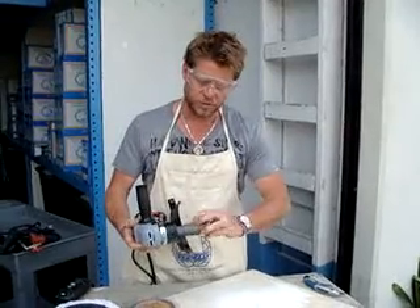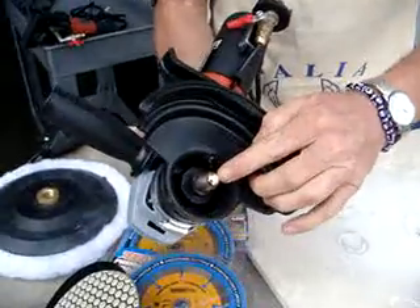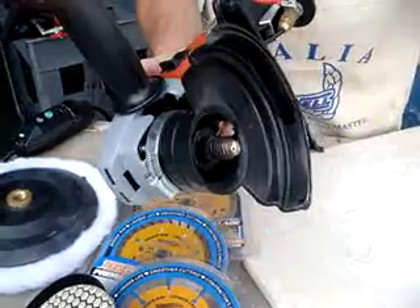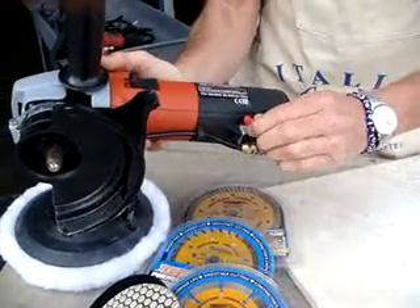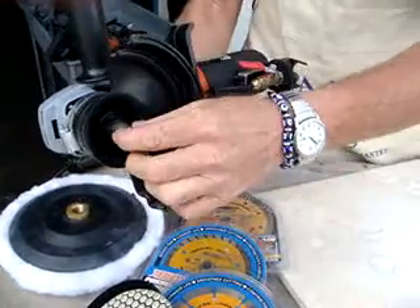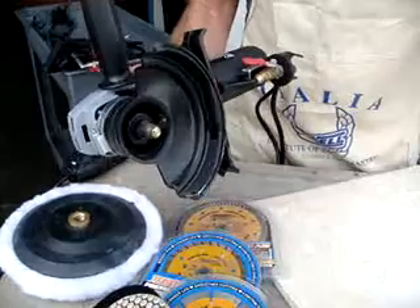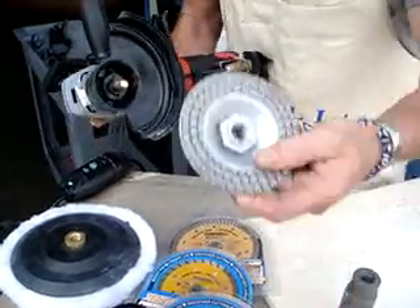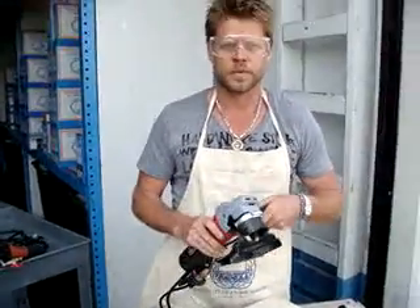One last feature on this unit I'm going to show you: this is where the water feed occurs, at the end of the unit. So you don't have to worry about water getting around the motor. It runs from the back right here — variable speed for your water — comes out your pin right here, and it's always coming from the interior of your cutting tool, whether it's your core bit, your grinding cup, or your diamond blade.